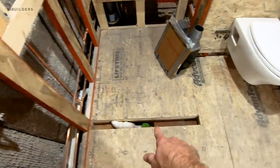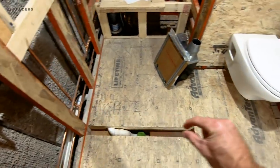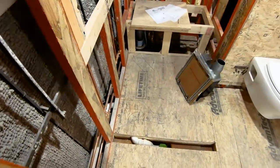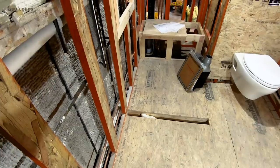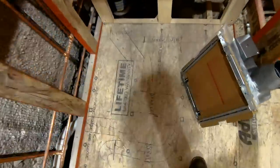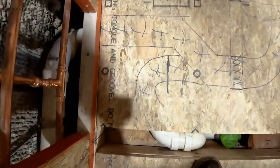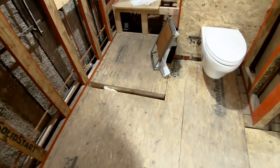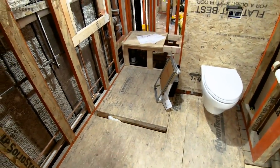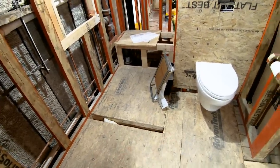It's really important to do a full linear drain all the way wall to wall — we'll actually do a tiled one, so you have essentially an eighth-inch slot all the way around. When water runs back, it has to hit that drain, and anything that might make it past will hit the glass door and the squeegee and go back in. The guys actually marked it all in the ground — you can see all the funky plumbing. That drain goes around and ties back to the cast iron. A lot of forethought and thinking has to go into this, especially with a curbless entry and making sure that drain is exactly the right width.